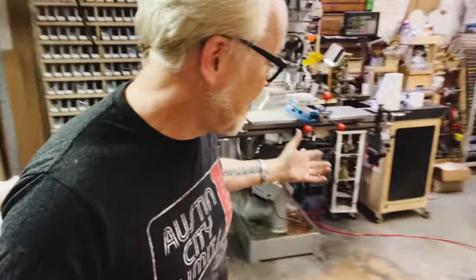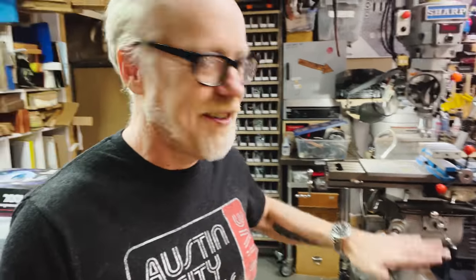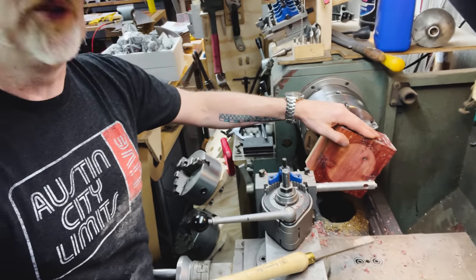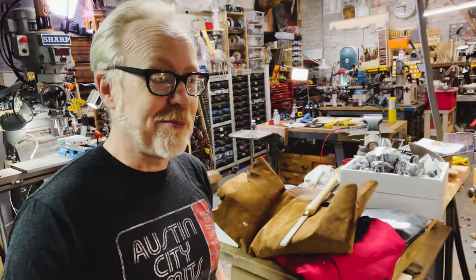And I realized if I'm going to make this circle, I'm going to need a dishing block. I'm going to need a piece of wood that I can hammer into. Now, normally, what I really want is a dishing stump. I just haven't gotten around to buying a stump and then dishing it. But what I do have is a chunk of cedar. This is one of the chunks I purchased for the Samaritan grips. And I've chucked it onto my lathe, and I'm about to carve a dish in it, and then we'll get to the hammering.